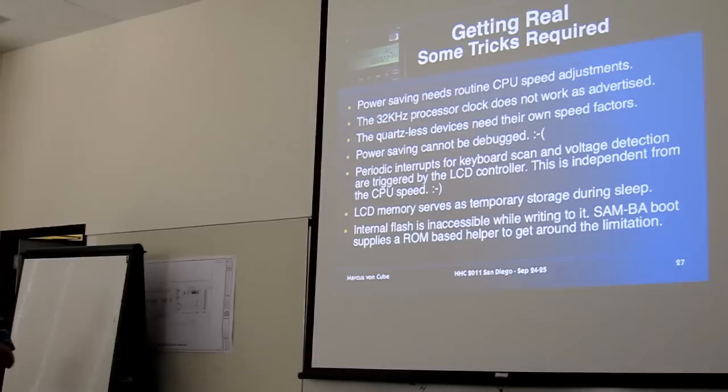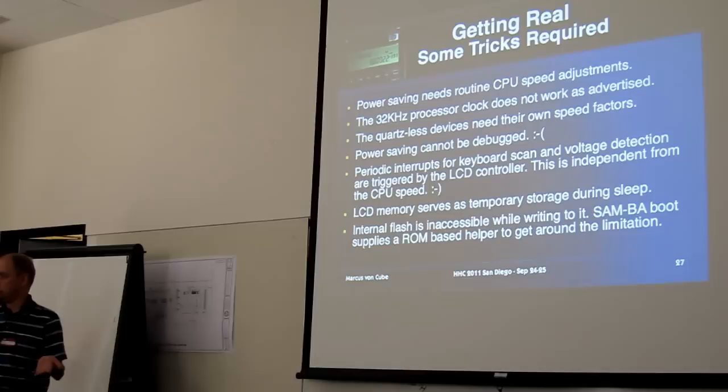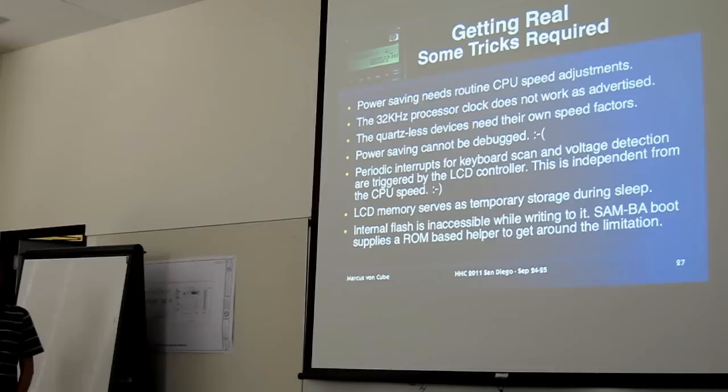The chip draws 20 milliamps on full power, and the batteries are rated for 200 milliamp hours. You have two of them. It's very easy to get them flat. So power saving is a big part of what has to be done, and power saving means that you have to turn the device off most of the time. Cyril has done a very, very good job.